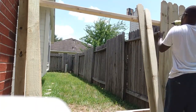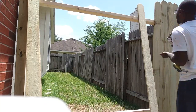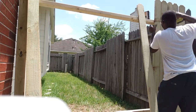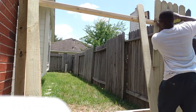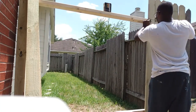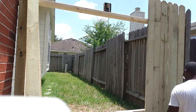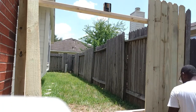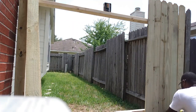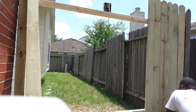It's not really hard. Anybody with basic handy skills and basic tools can do a job like this, especially for the average homeowner who doesn't want to spend a couple hundred bucks having somebody come out and repair their fence. Just pay for the materials and take care of it yourself. I'm putting two screws in at the top and two at the bottom for each picket.